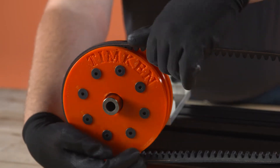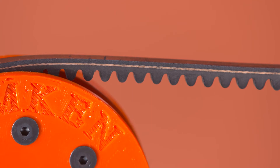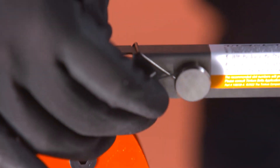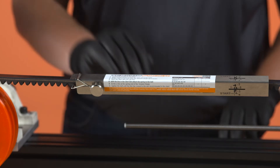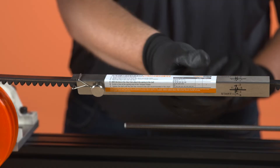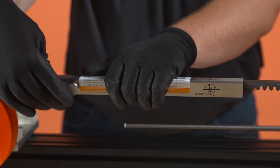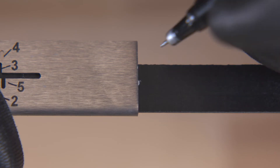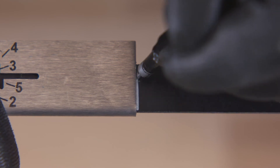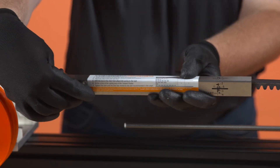When using a cog belt, take the following steps. The best place for the spring is between the cogs. Place the spring in a groove between two cogs. Put a dot in the start slot — be careful not to catch the pen in the slot, as you may pull the tip out of the pen. Scribe a line through the dot; the line should extend across the width of the Tension Finder tool. Now, follow the rest of the procedure we talked about earlier.